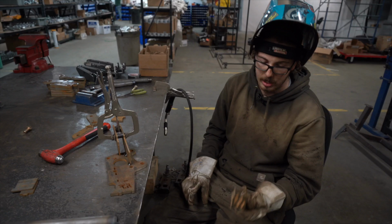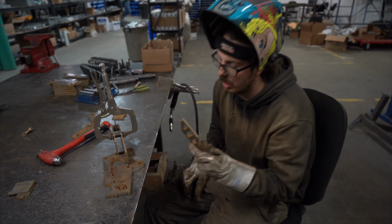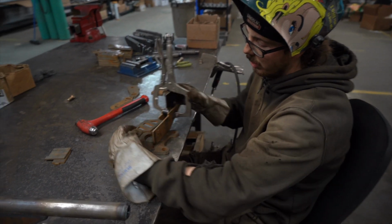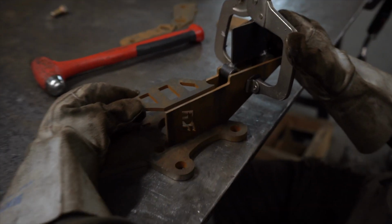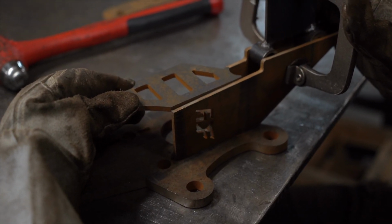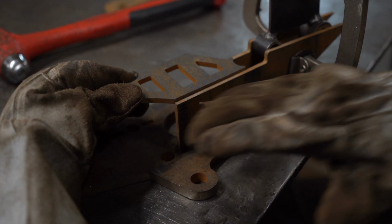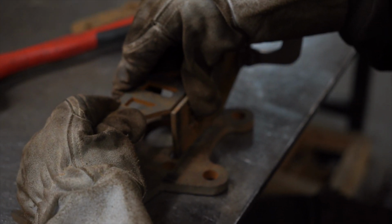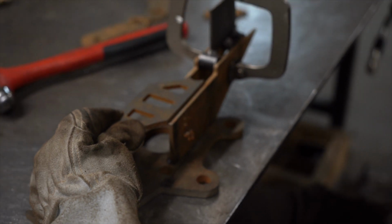So now we have our only piece on this knuckle that does not have a slot or a tab on it, and it fits edge to edge, we call it, up against this side piece here. So once it's nice and flush across the top, you can tack that in and it locates the rest of our parts on the knuckle.